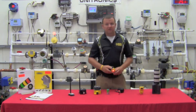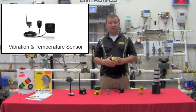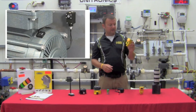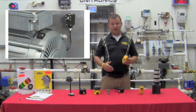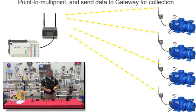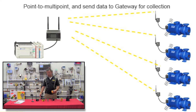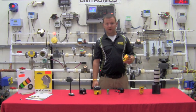Another feature is a wireless node combined with a temperature and vibration sensor. The sensor can magnetically mount right to the outside of a drive, motor, or fan. Using this conduit-free, battery-powered wireless radio, you can do field surveys on equipment for preventive maintenance purposes — simply walk up, set the vibration sensor on the motor, place the radio next to it, and it will communicate back to the gateway and feed that information into your PLC to help plan preventive maintenance.